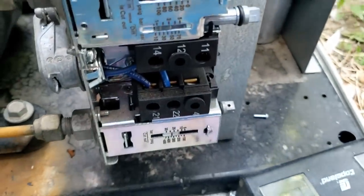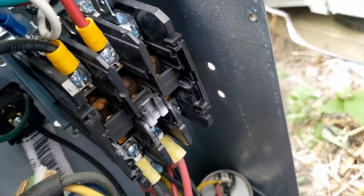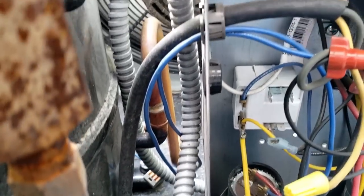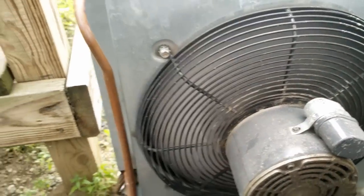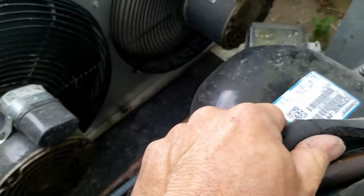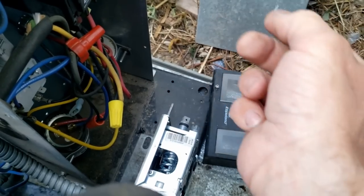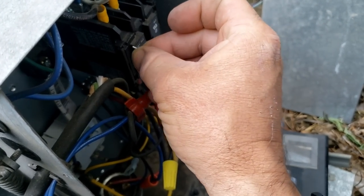The part's running. I'm checking temperatures for my shut-off. I also took the cover off, checking the contactor, making sure everything's good to go, checking all wire connections, looking at the capacitors, looking for burnt wires. We're looking at that coil - we may have multiple issues here. Going through and just trying to eliminate things. That's a rub-out just waiting to happen - stupid stuff like this that you just got to look at and find all the other stuff that's likely going out next.